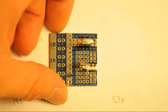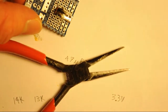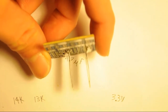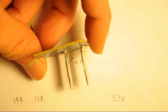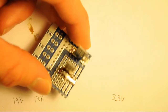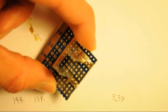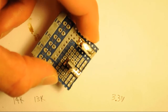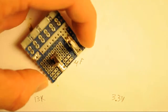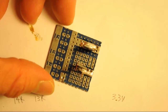Okay, we've soldered on our prongs here, and I actually did use an extra tool. I used a pair of needle nose to hold the prongs on there, and after you get them on there, spread them out a little bit, give it a little bit of thickness, so when you plug it in, you'll get it kind of firm, but not too firm, because you still have to take it out without too many problems. So yeah, it took a bit of solder, but it's on there pretty good, and it fits. Do test it, try it out, make sure it fits.